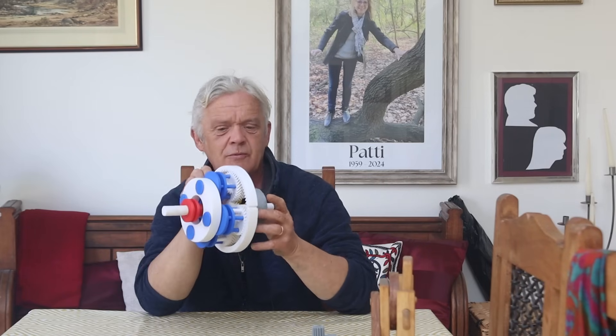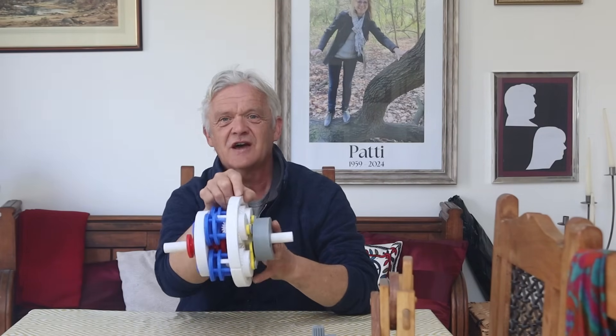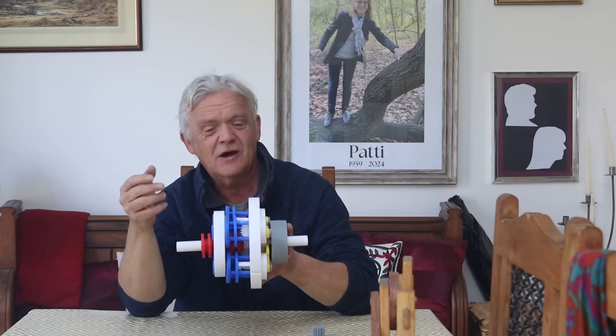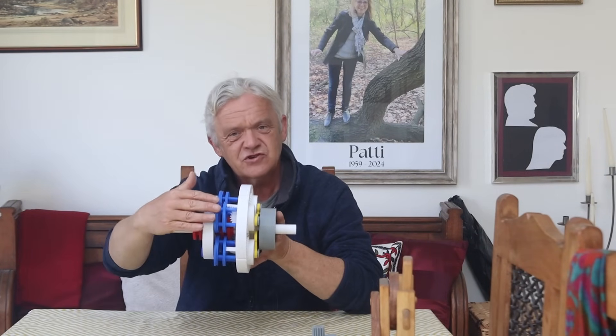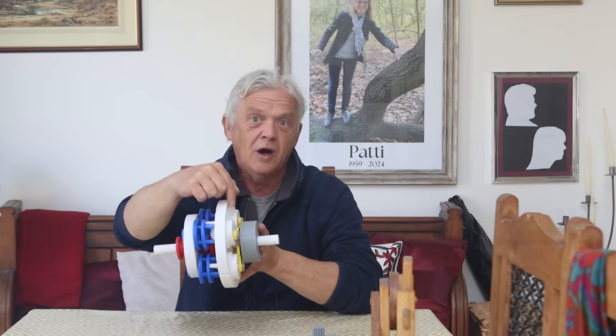Now, based on what we did with this, remember there are quite a few mechanisms here. One of the mechanisms I thought was kind of cute - and came up with myself - was this ability to push a selector in and out, have it work a gear, and have that gear move the pin. I thought: could we do that with a scotch yoke? And of course the answer is yes.